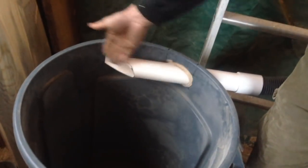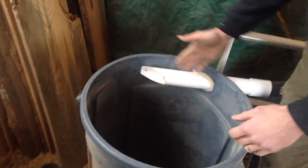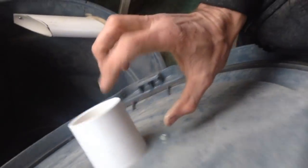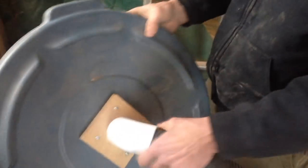Other videos I watched said this angle was pretty crucial. The vacuum is pulling from the top and the dust is coming in this way — it creates a little cyclone. Everything gets trapped into the trash can and nothing goes into the vacuum. Apparently the cut angle, the inlet being high, and the outlet port being at the center are the key features that make that cyclone happen. I also have another 2-inch coupler with a short piece of 2-inch PVC and a little elbow, all friction fit. I put a little piece of particle board on there to make it more stable since the lid surface is so flexy.